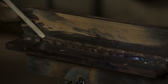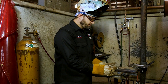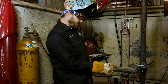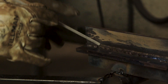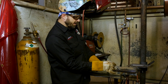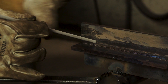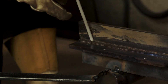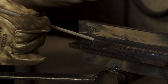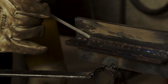If you're running with so much of a downward angle, you're going to end up with undercut all along the top of the plate. So what you want to do is drop your angle down so you get more metal on the top of the plate. Something like a 35 degree angle, maybe 25 — somewhere in there. That way you can get more of your metal up on the top edge and get a nice little fillet bead. If you run it too steep, you'll get undercut, so drop your angle as you move up the plate.